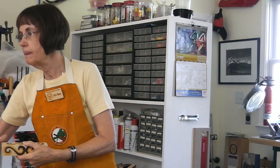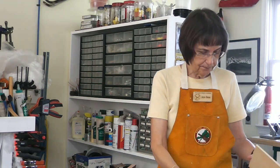Now, if you take colored pencils and then burn on top of it, does it burn that color into the wood? Burn it and then color it with a pencil? I burn it and then color. And color. Right. And then after that, these are oil pencils, not colored pencils, and I usually finish with oil. So what I did is I took shellac and carefully, with a tiny brush, painted over all the color. And then I could just finish it with no problem.